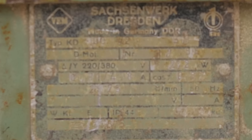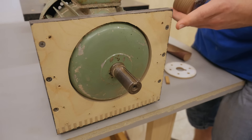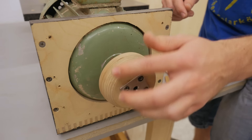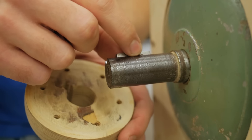For those of you who don't already know, this is a three horsepower motor that I got for 10 euros off eBay. It runs on three-phase power and yes, we have three-phase power supply in the house. One of the challenges with making a blower this powerful is to make a mounting flange that can transfer this power to the impeller while still making it out of wood. With the original shaft key I was afraid that it would dig too much into the wood and maybe not work properly.